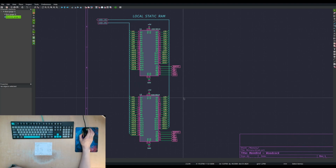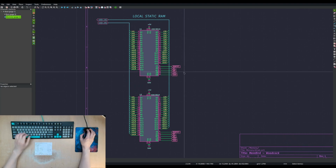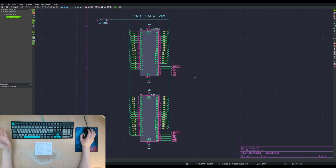So we're going to need to do some stuff with them. We're not going to be able to use them directly off the bus. Primarily, this is because we would like to be able to use 3.3 volt chips, or even possibly a different voltage of chips. So we would have to convert those signals coming off of the bus. We're only going to be reading them, so we just need one direction. So we'll convert them from bus voltage down to whatever our board voltage is. And we'll call them LDS and UDS when we do that. We're going to need a read and write. We'll derive them possibly from other conditions more than just the one.